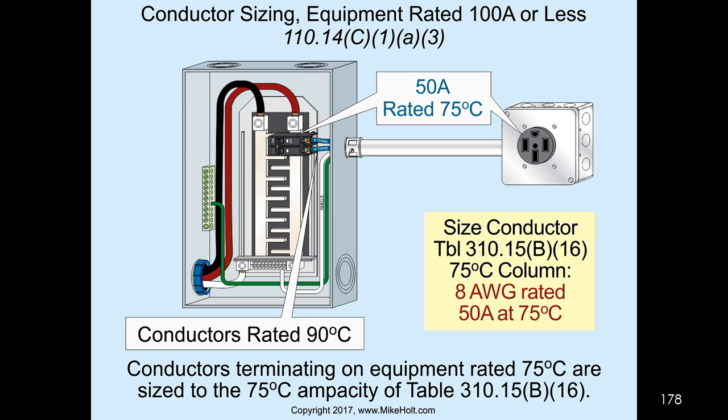Brian. So now let me understand what you just said. You said today's breakers, the terminals are now rated for 75 degrees? Sure, they all are. Really? Okay. Oh, man, many years ago. Now here's what happened. The breakers were never rated for 60 degrees C. The wire is rated for 90 degrees C, and nobody paid attention to the terminals.